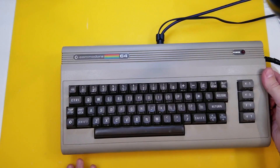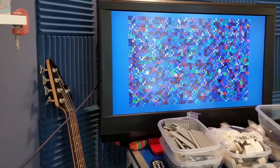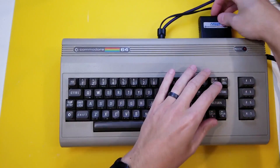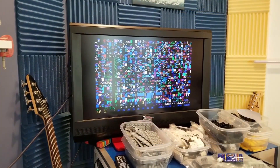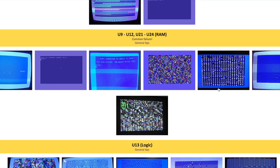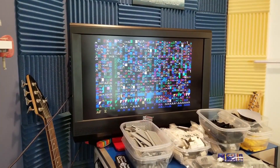Here's the machine in question. This was given to us by David Philippe Gill, and you can see the problem. Similar story with Jupiter Lander, which is a handy cartridge to use because it doesn't require the kernel and some other chips, so it can help narrow things down. If we consult the pictorial C64 fault guide, you can see the section with by far the most faults is the RAM section, and this looks pretty similar.